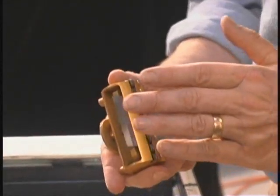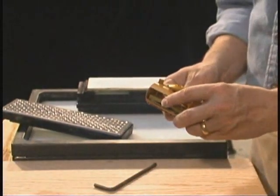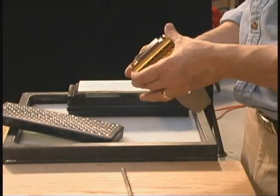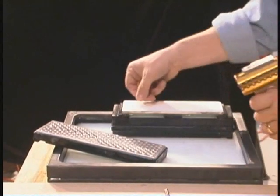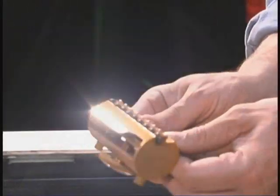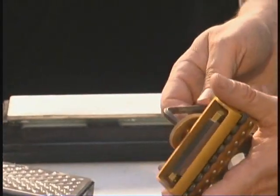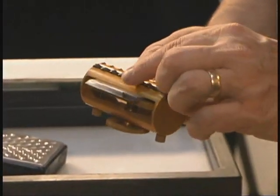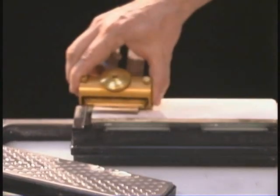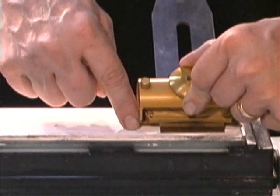If you want to raise the angle and sharpen at a steeper angle, then loosen the head screw and slide the jig forward just the tiniest amount. It's really a very precision jig so you don't need to go very far at all. Snug it back up and then begin sharpening. You can see we've got a dark thin line here on the stone, and that means that we're making contact right along the front edge of the tool — so we have created a micro bevel. If you want to shallow your bevel, then you'll need to loosen the head screw and back the jig up a hair. Tighten it up, be sure that it's nice and square. Now it's hitting right along the heel of the blade, which means that we are now shallowing the sharpening angle.